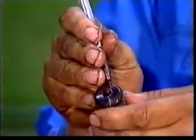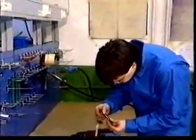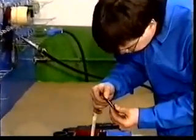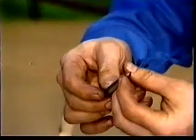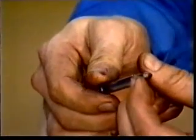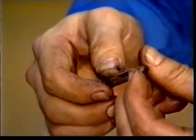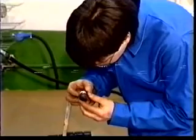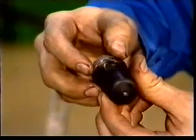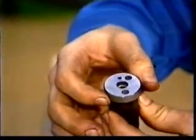Checking of the nozzle. Check the nozzles ocularly, especially for impact or a scratched needle seat face. Worn or damaged needle pins. Damaged body seats. Nozzle tips damaged by corrosion. Clogged nozzle orifices. Scratches or seizures on the needle sliding face. Sealing face against the nozzle holder.